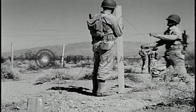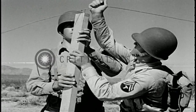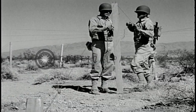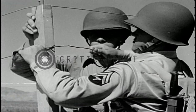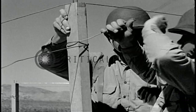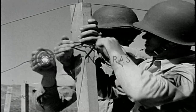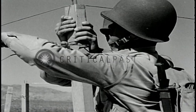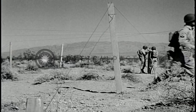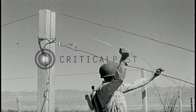When the radial wires are all in place, they are put between the nails at the top of the poles. Then the poles are forced outward to a vertical position, which automatically tightens the wires. The ends of the wires are tied near the tops of the poles to prevent slipping. The edge wires are then run out.